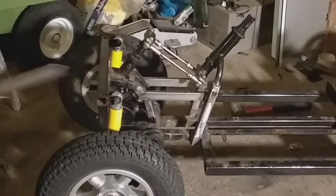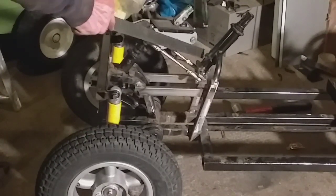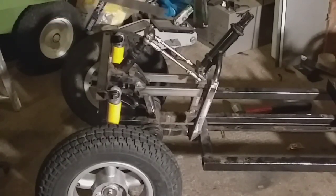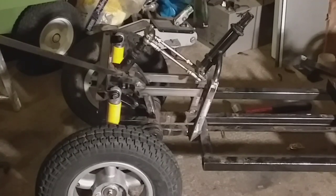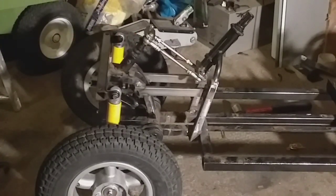This steering has worked out really good and I'm over the moon with it — it's all operating as it should. The thing is, if you're going to do this, you need to make sure these two bits of metal you drill together on top of each other to make sure the distances are the same, and also with these two distances here — when you weld that on, you weld it on in the middle, so you're not going to jam it up in any way. The good thing about this is instead of having bolts through here and adjusting the chain, you can adjust these linkage rods instead. All this is welded on solid. I hope you're learning something out of this video, because it was worth doing it just to show you something sensible.